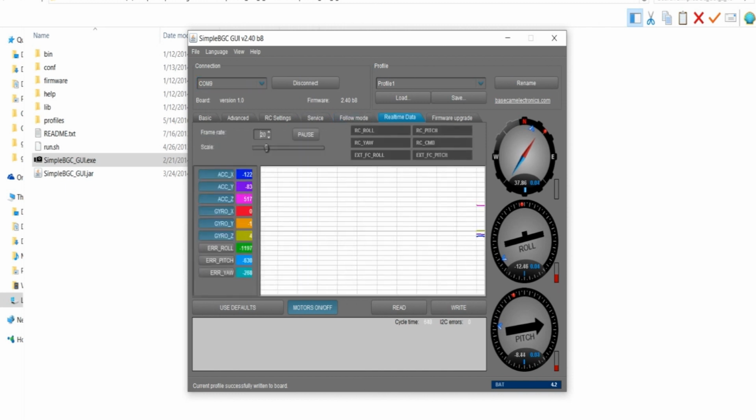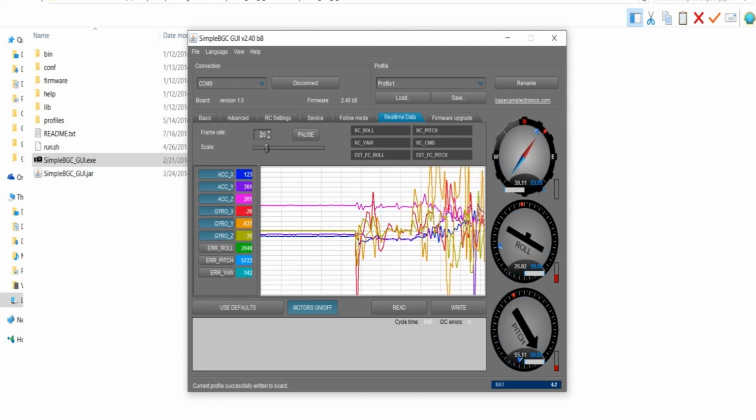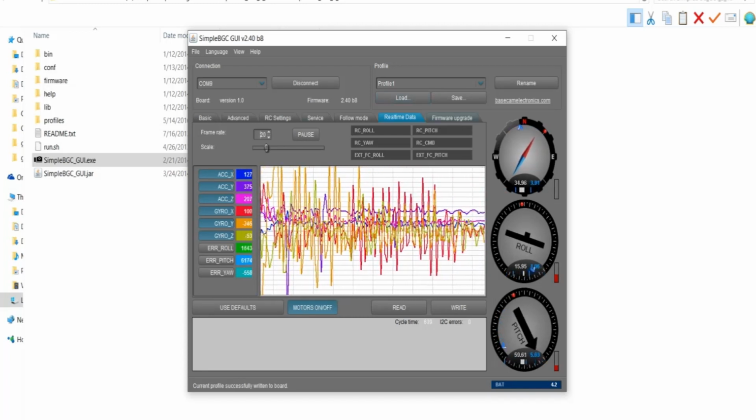The follow me mode, I did nothing. Here you can just snoop the data. This is handy for when you're doing the PIDs and stuff. Your lines should be nice and flat. They shouldn't be like that. If it's all over and the motor's shaking, there's something drastically wrong and you're going to have to play around with it until you figure it out.